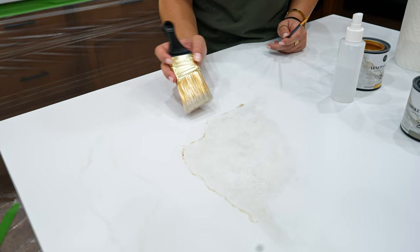When you finish stirring, immediately pour the entire mixture onto the first section of your countertops. It helps to pour the mixture in 3 streams to ensure even coverage. Start by pouring 1 stream at the base of your backsplash, 1 in the center of your countertops, and 1 close to the edge. If you have an object within your 6-foot section, such as a sink, simply use the proportionate amount for one side and continue on the opposite side of the sink until the entire mixture has been used.